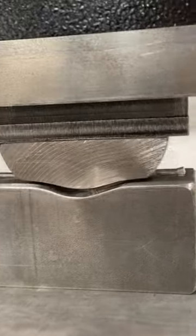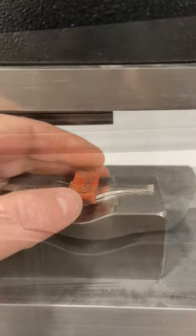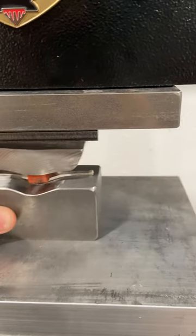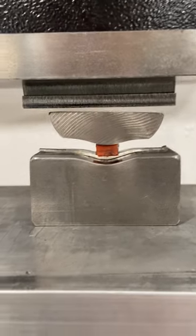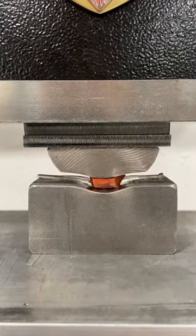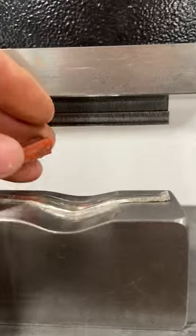Here I'm using the humpback ring kit, also available from Potter USA. This is a specially shaped pusher that conforms to the humpback shape of the impression die. Now I'm combining the humpback ring pusher with a small piece of urethane so that I can get down into the deepest part of the die and pick up as much detail as possible.